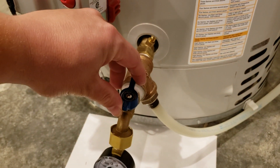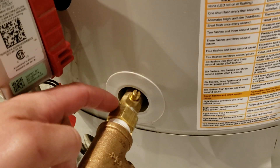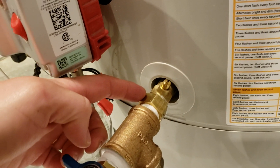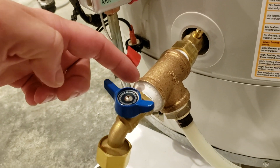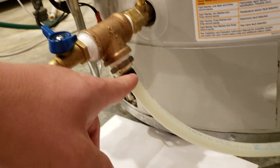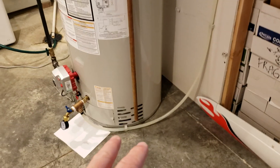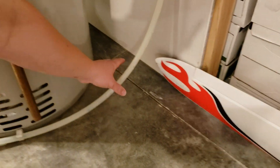So now I can just shut this off so I don't have to worry about leaks. This was tricky here because this is a hose fitting, like a garden hose — three-quarter to three-quarter pipe, to three-quarter pipe, to three-quarter pipe, down to half-inch PEX. And we've got another piece of PEX here that we're going to add on that's going to clean this up. Basically, we're going to have a 90, and then it's going to come straight over, and then 90 straight up, just to make it a little neater and to keep stuff out of this corner.